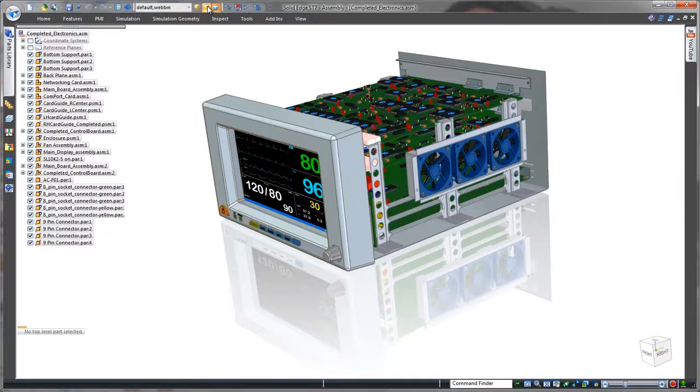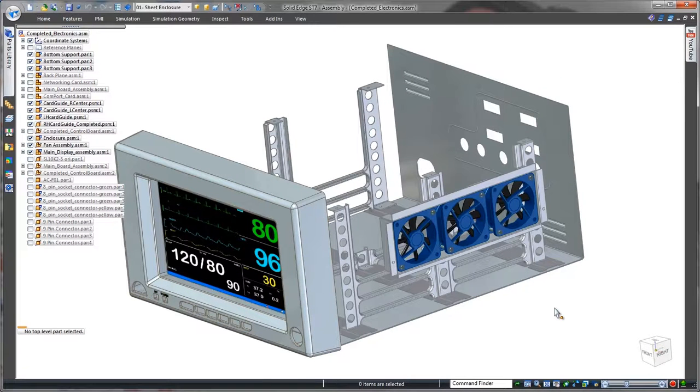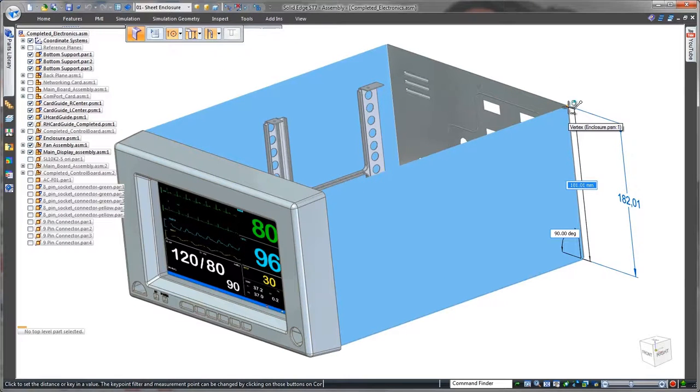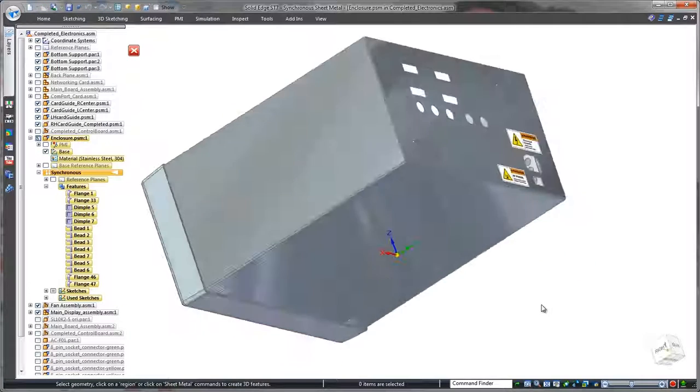We'll use Solid Edge to complete the enclosure of this heart rate monitor. Solid Edge with synchronous technology excels in sheet metal construction, allowing designers to efficiently work with surrounding components to define external product housings. In most CAD systems, the user has to modify a part independently from the overall product assembly. With Solid Edge, additional flanges can be created at the top-level assembly just by selecting and dragging the plate's thickness faces. No special command necessary.